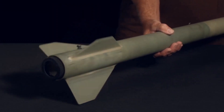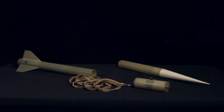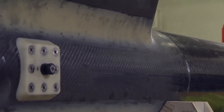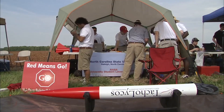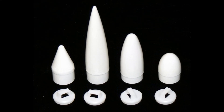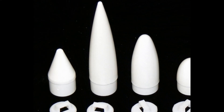Another crucial part on the body is the fins. These fins, which are produced and placed according to the aerodynamic structure of the rocket, help stabilize the rocket during its ascent. In basic level rockets, these structures are fixed to the body; in more complex rockets, just like in military missiles, they can change direction to steer. The nose cone is the other component mounted on the body. This part is most exposed to friction during launch and helps the rocket move through the air. The shape and design of the nose cone vary based on the rocket's intended maximum altitude and power. Moreover, it should be solid yet lightweight to avoid disturbing the rocket's center of gravity.